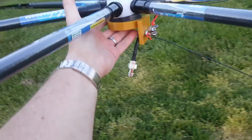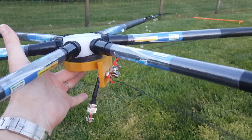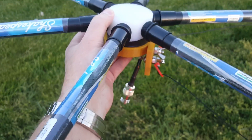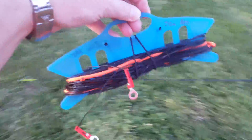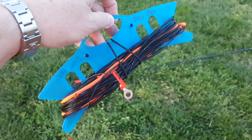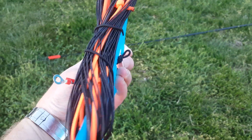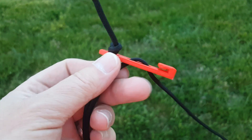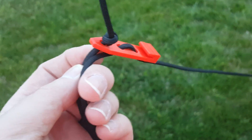Here I'm holding the center hub balanced on one finger — you can see it's very lightweight, which is important since it's up at height. The electrical tape on the hub makes the feed point fit more snugly. You can see how the wire kit attaches to the wing nuts and the little pigtail hanging down where the coax attaches. Make sure you build this light — if you build one yourself, make sure the hub is as light as you can make it. Here's the 20-meter wire kit on a wire winder, very compact as one continuous piece. You attach one side of the driven element to a wing nut at the center hub, then walk around the antenna, stretching the wire around those orange 3D printed spreader stoppers. Here are some guy rope tensioners — you can buy these at any camping store — used to adjust the tension on guy ropes.